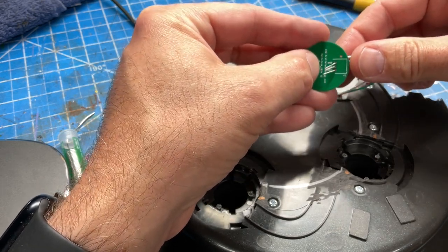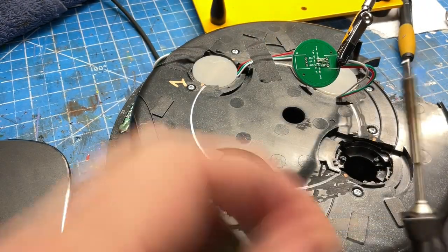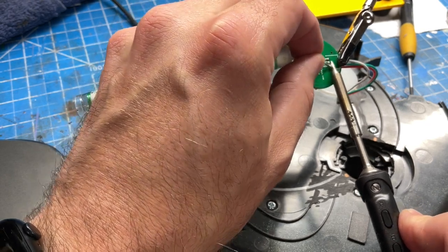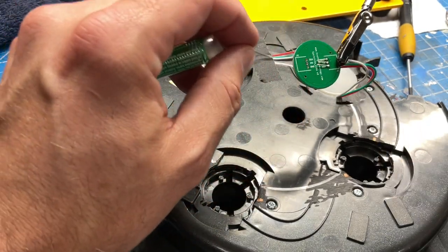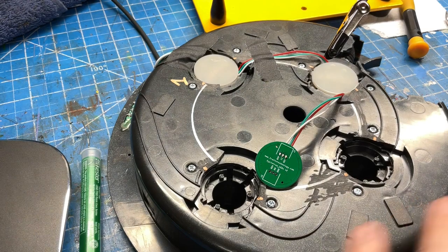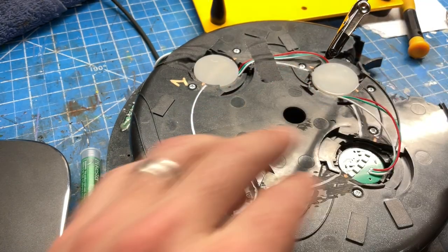Do the process again — red for positive, green for data, and white for negative. As long as we keep that pattern going, we're all good. Double check that: ground is white and we're going to the DI pin — and that's the other thing, just double check every now and then. I think I'm getting a little bit better at this with the tinier wires. Snip off the excess and double check our fit. We're good — should be able to tuck that in there.